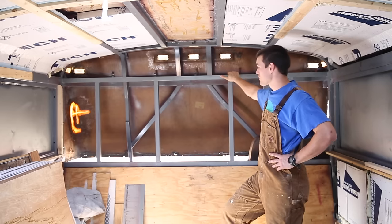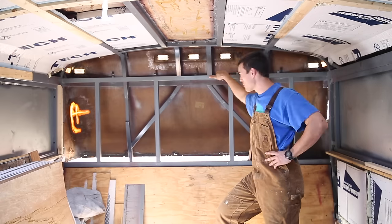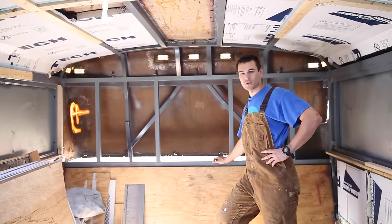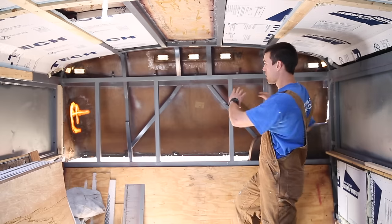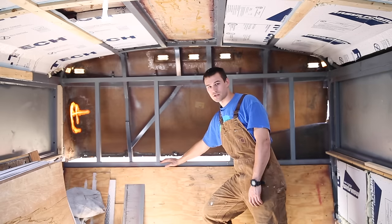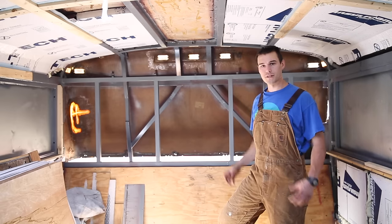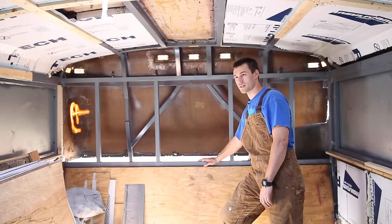Last Saturday we got the back wall studs installed — it's pretty sturdy. We have a one-by-two rectangular pipe up top and one-and-three-quarter by one-and-three-quarter tube down below. It was all leftover material from the roof raise, windows, and other projects, so it worked out well. We welded it in place, making sure everything was square and level — tacking bottom first, then tacking the top, checking plumb before fully welding everything.